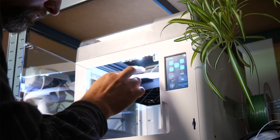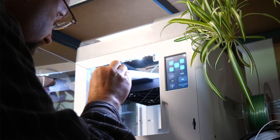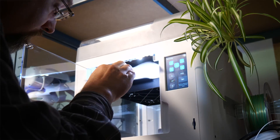I'm not really sure why, but I do think there's a good reason. Most printers have the z-axis for the printhead on a dual drive gantry system, rather than this type of design where the entire print bed moves up and down, with movements only coming from the drive axis on one side. That said, I haven't had any adhesion or first layer problems — so while the leveling is unreliable, it doesn't seem to matter.